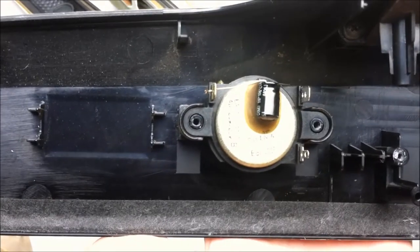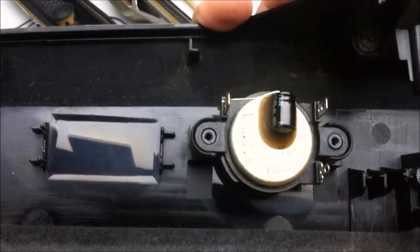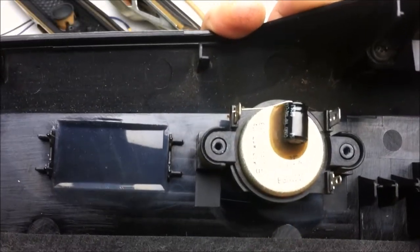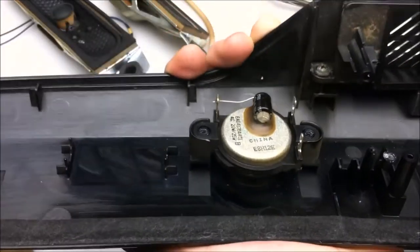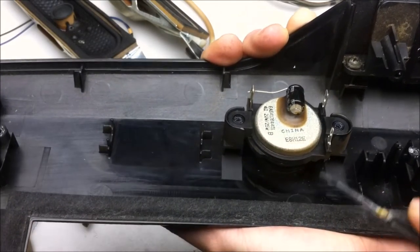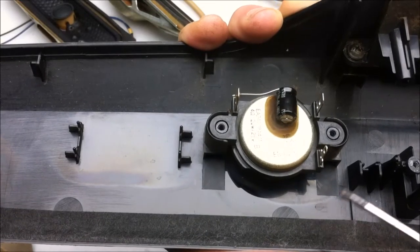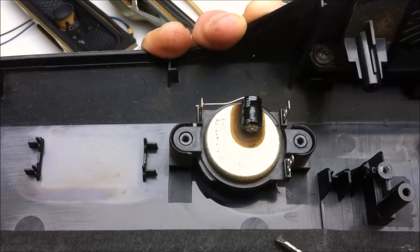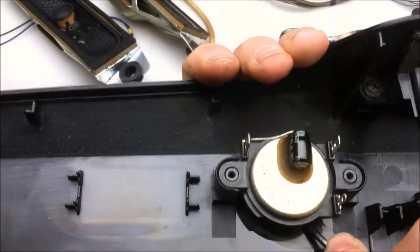One other thing to note from the 42 inch LG is it has these little tweeters right here, and these are for dealing with the really high frequency treble sounds, and it'd be great to pull off, except they are glued down to the actual front of the TV frame, so they vibrate this material. See if I can get one of these off without damaging it. I've already destroyed the other one and they're decently glued on. Let's see what happens.